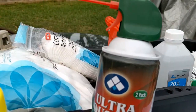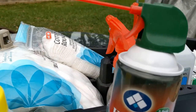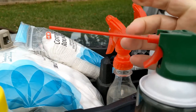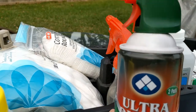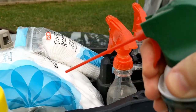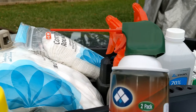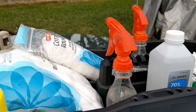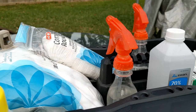Now let's talk about a controversial topic: canned air. Absolutely do not shake it. If you want to try to use it, pull the trigger very gently — pulling it hard will cause the propellant to come out and shoot onto whatever you're cleaning. You could use it to blow off big debris from a corrector plate or mirror, but I tend to stay clear of canned air to be honest. I have this cleaning kit put together and I'll use it whenever I need it.